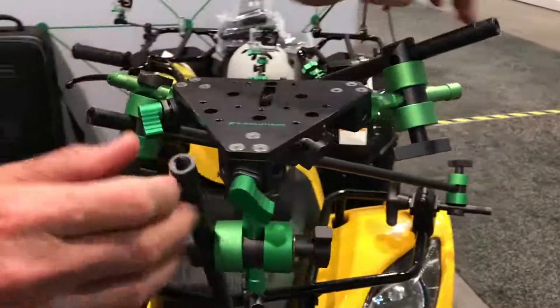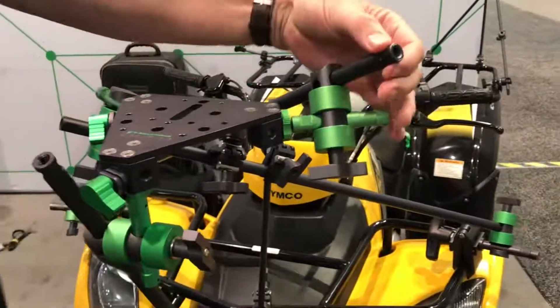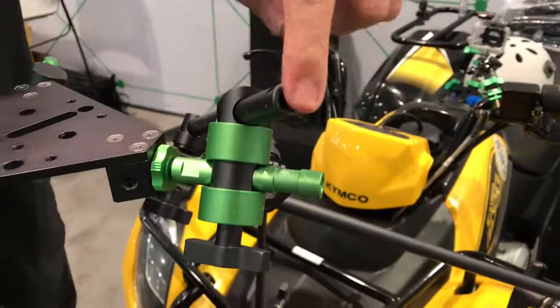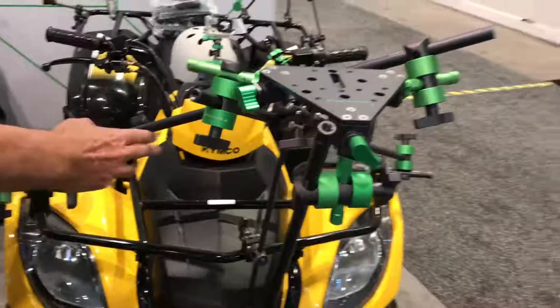What we're looking at here is a system of 5/8" rods. All these 5/8" rods are extruded 6061 aluminum. They're all drilled and tapped on the ends with 3/8" bolts. And then this one is our 750 millimeter length.